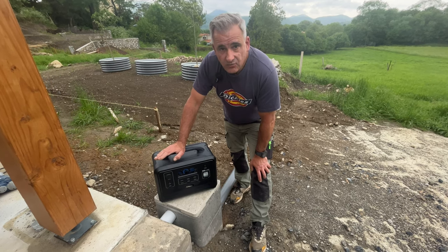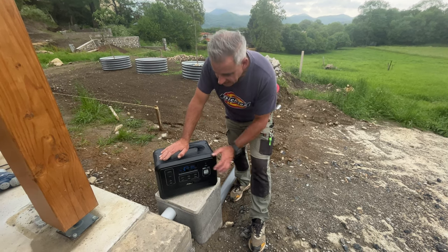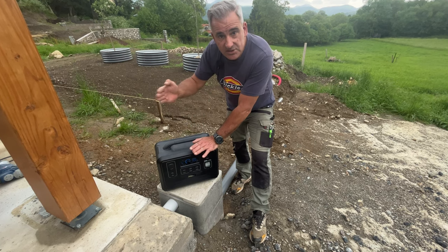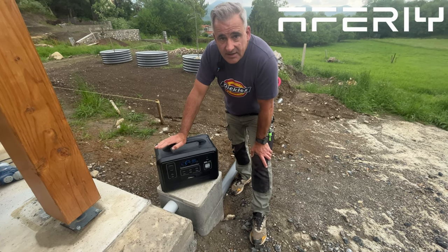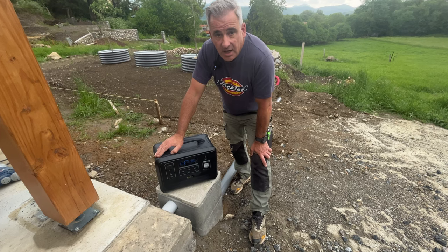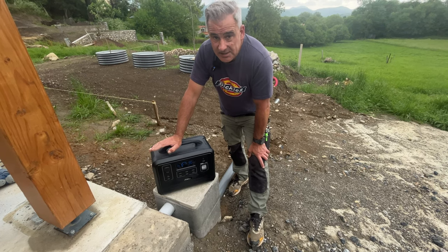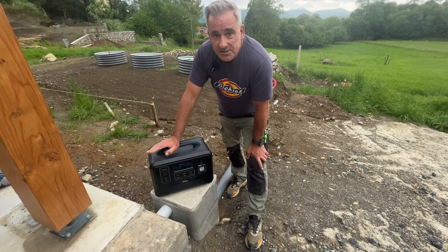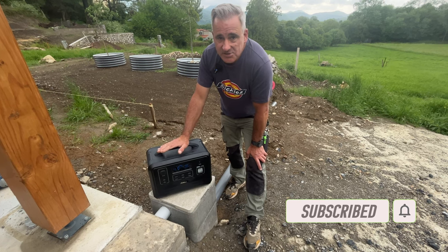Also, this will never go right down. The BMS, the battery management system, will always allow 10% of battery in this unit. Even though the display may say 0%, it will keep 10% in there and that allows the battery to have much longer longevity and will last a long, long time. So I want to really thank Aferi for supplying this portable power station to us to test out, try out and to use now in our garage, our build, our off-grid homestead and at the house as well for emergency use as an uninterrupted power supply. As you know we have quite a few power outages here and our freezers are susceptible to losing all our good food. If you like this video stick the thumbs up and hit that subscribe. All the information for this unit will be down in the description. See you next time. Bye.